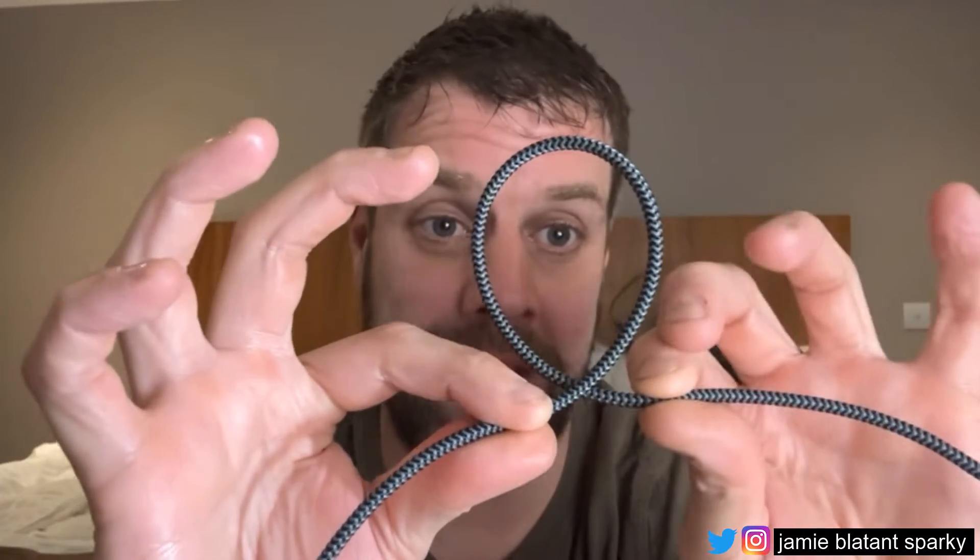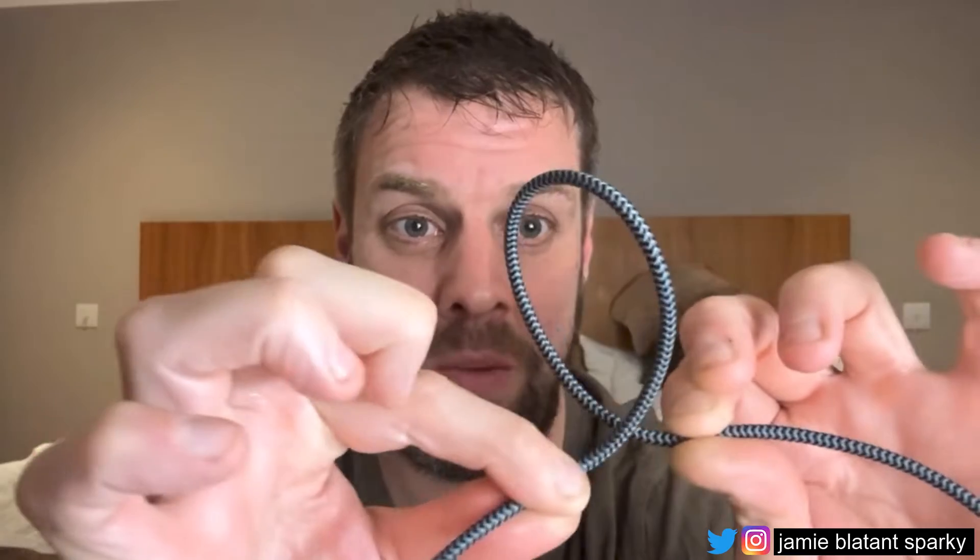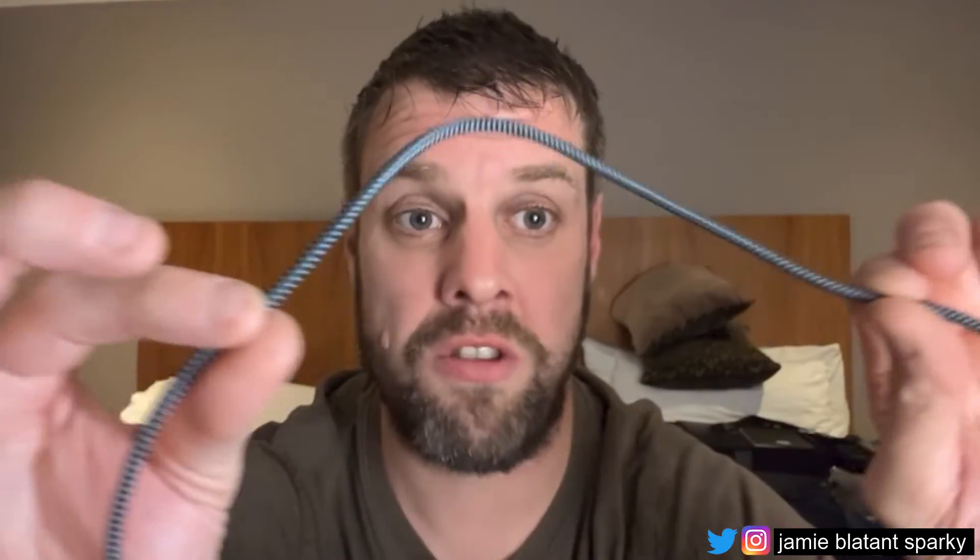You'll feel the cable between your fingers twisting them. Now hold it tight and try and pull it apart - that twist will never ever come out of that cable. You'll see it's still there. If I push it back, it forms back up. Pull it back, that's straight now but it's still there. Push it back and the twist comes back. Let your fingers go loose and pull it tight, then grab it - the twist has gone. That is a cable twist. You must avoid this.